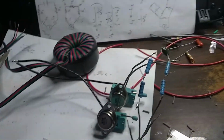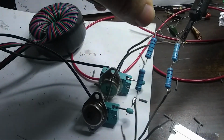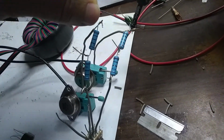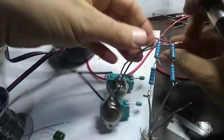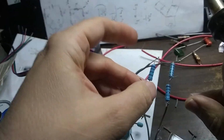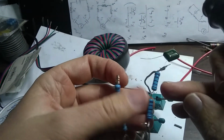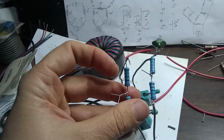And let me get my solder. Yeah, it's hot. Okay, so there we go. Soldering that capacitor in place. That should be good and soldered in place, and I'll get the other one on there on the other side, because this is kind of a symmetric circuit. We have a capacitor on this side, capacitor on that side, and the two timing capacitors. Okay, and we'll get that going.